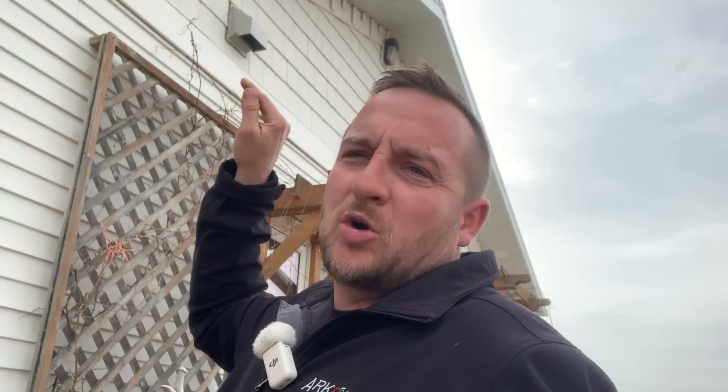The inspector used it to check the attic and in part of the house, with the wind blowing so bad up through the soffits, it actually blows the blown-in insulation away and creates voids. There was a spot in this newer house with no insulation in the attic because the attic insulation had blown away. To prevent that, you'd know to block some of the soffits and stop the wind from blowing away that insulation. It's an incredible tool — without going up in the attic and crawling around, there's no way you can see it. The thermal imager is incredible.